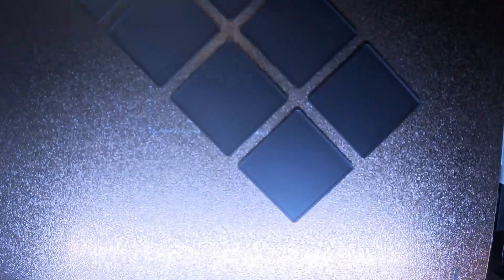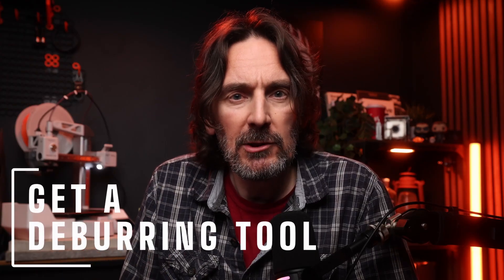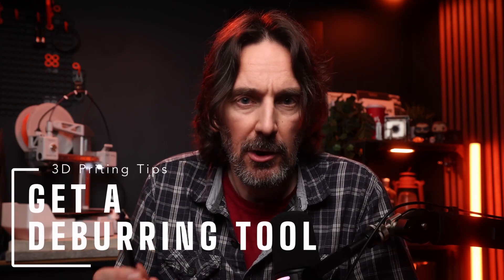When you get the bug, you'll want to print as much as you can, but it's quite hard if the other people in the house are moaning about the noise — and these things can be a bit noisy. I made another video on this topic, so click up here or down in the description where I've talked about how I use foam and paving slabs to keep things quiet. I won't talk about tools in great depth, but I will mention this deburring tool. It's ideal for getting rid of elephant's foot, brims, or anything like that, and it's so much safer than using a knife — and much quicker too. If there's a hole in your print that's just a smidge too small, you can do a little twizzle with it as well.